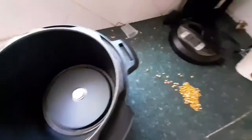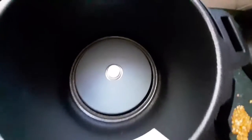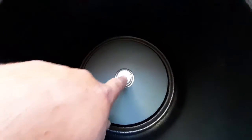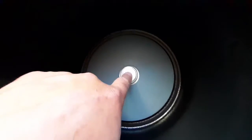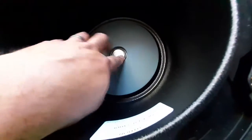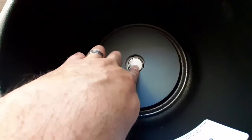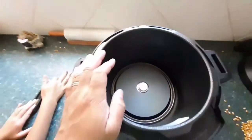So my analysis of this is, as far as I can see what happened was, the corn fell in here and then went and pushed this button or pushed this over here. And the corn went through this gap there. I could also see that underneath this plate there were some holes under there where the corn fell through as well. But it's not completely open — there's just a couple of holes over there.